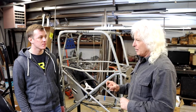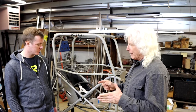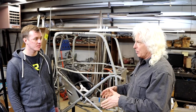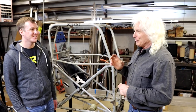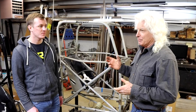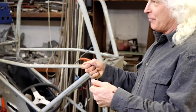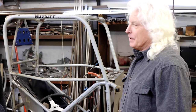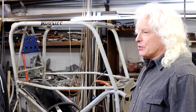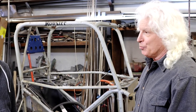I had all the individual components designed at the time — like little bushings for axle parts. I designed the front axle ahead of time. I had a little Volkswagen engine drawn to scale and put that in the car to get the engine placement. I had a little scaled driver — a representative of the average male figure — sitting in the seat. So I had the steering wheel placement and everything based off my little movable figure. Everything was worked out before I even started. Then I handed off individual components to friends and family who had machine shops to make smaller bushings and spacers.